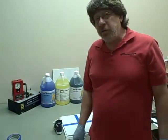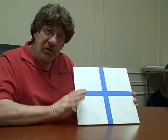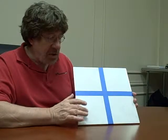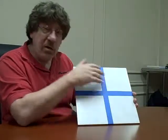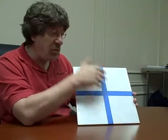So what I'm going to do now is let this tile dry and look at each of the four quadrants when dry, just to make sure I don't have any appearance change. Then we'll make a decision on which product to use. We took the tile into a room with different lighting and also outside, just to see if there's any appearance change. We noticed almost no visible change in appearance at all — maybe a slight change with the concrete, but the blue and the yellow products, Stone Grip and industrial strength, both provided an increase in traction with virtually no change in appearance. The choice for this project will be industrial strength yellow.